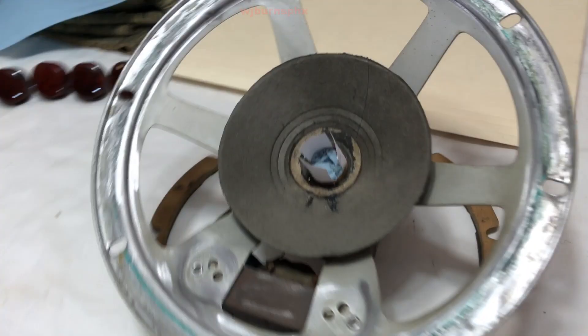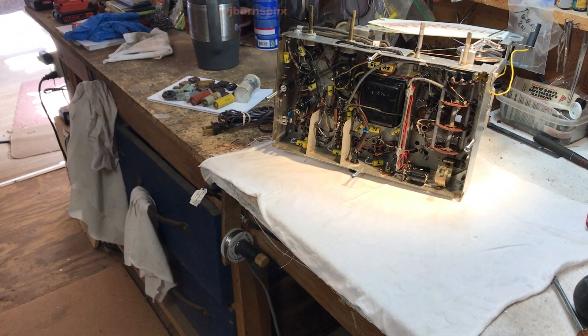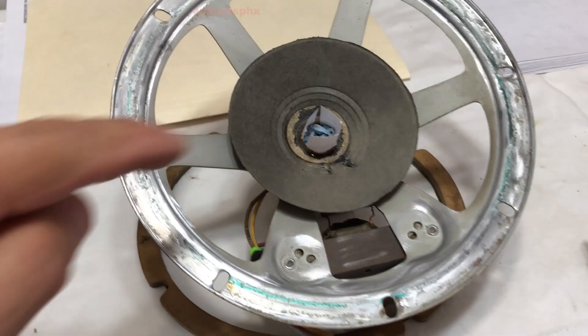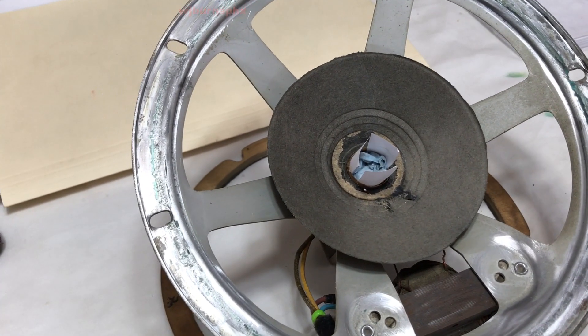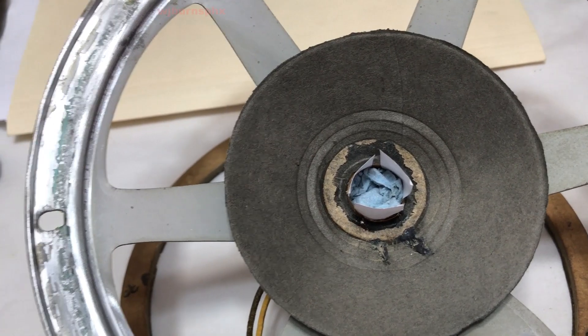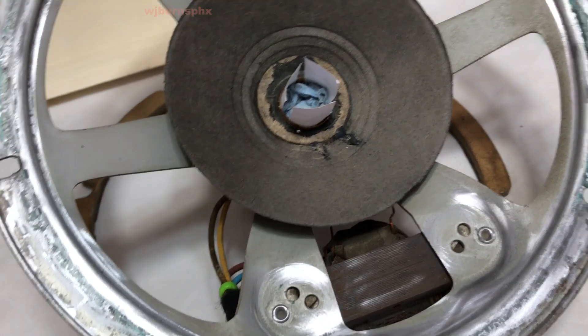There's a big issue with the speaker. I did a tentative power up on the chassis after I got the caps replaced and the cord replaced and everything back on it that needed to get on it in order to make a smoke test. I fired it up and there was a gnarly sound from the speaker — gnarly meaning serious rubbing on the voice coil. There was some warpage in the cone around the basket. And when I pulled the dust cover off, even the voice coil form was slightly warped. Wouldn't you know it — it might have suffered from moisture. The speaker looked like it had a buildup of dust on it.